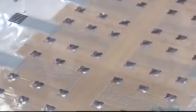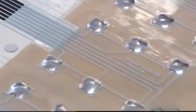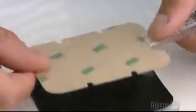They adhere a polyester sheet to hold the domes in place. After cutting out each circuitry layout and each graphic overlay, they expose the adhesive backing on the overlay and stick it to the circuit layer. The membrane switches are now complete.